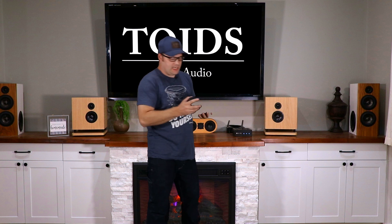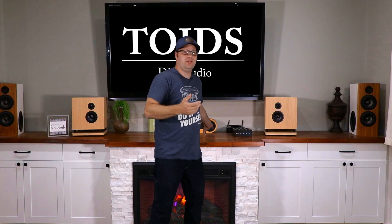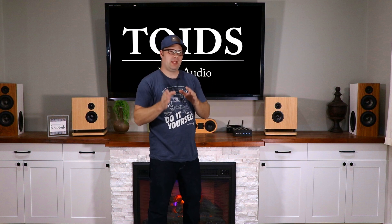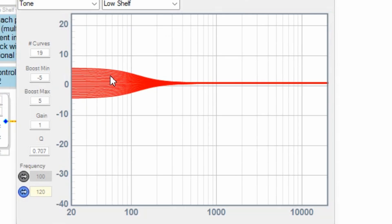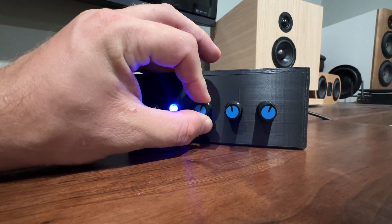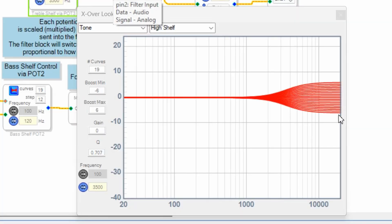With the DSP program I can add a bass knob — this potentiometer allows me to turn up the bass. Now we saw earlier that there was a distortion issue with the mid-range, so I wanted to make sure this potentiometer only affected the subwoofer. When I turn that frequency range from 120 Hz down to 30 Hz, it doesn't affect the frequency response of the mid-range at all — that stays stagnant, distortion stays down, and only the subwoofer is affected. The middle potentiometer affects the high-end response from about 1 kHz up to 20 kHz, and the last one is just a volume knob.